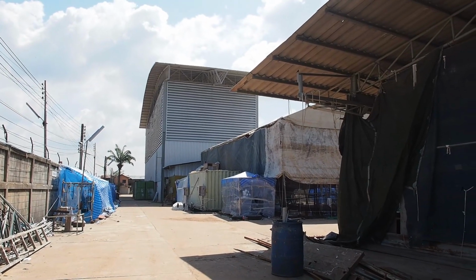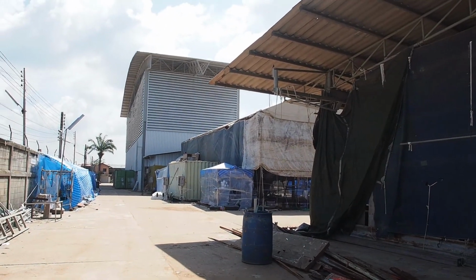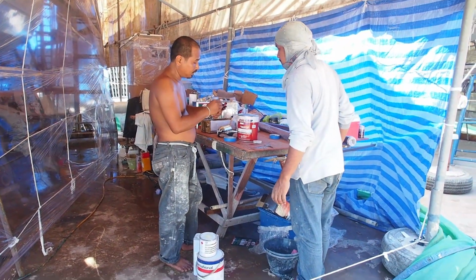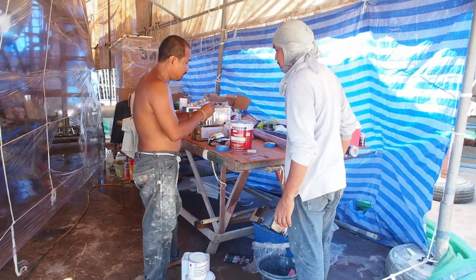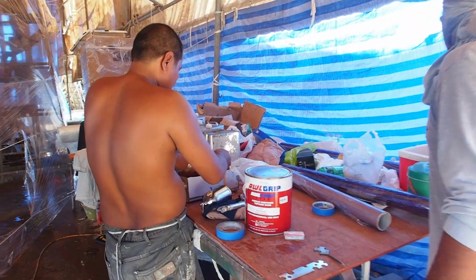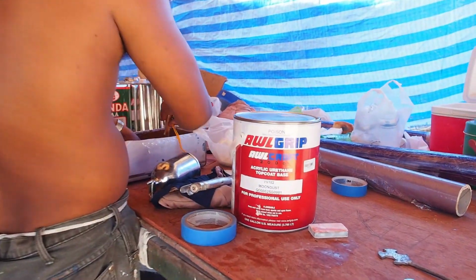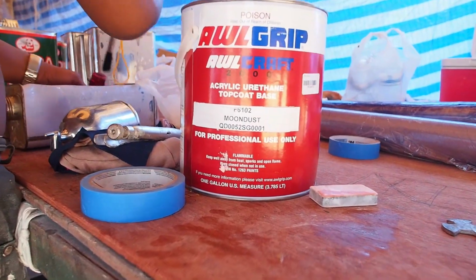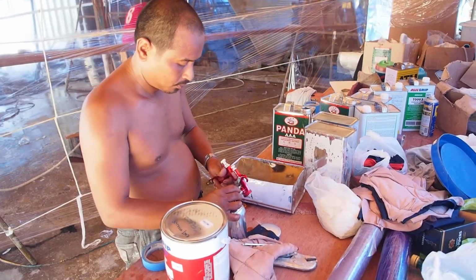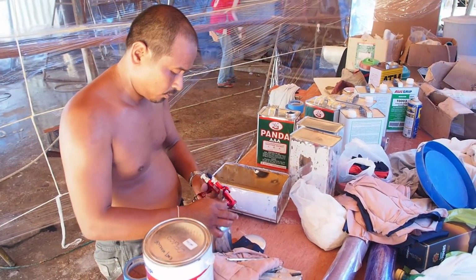So I've just taken a step back from the noisy tent over there. Been talking to Goy, the head painter. He just explained that he needs to put another layer of degreaser around the topsides before he applies the final top coat. So we're looking to get 3 coats on. It's 10:30 now, and he's estimating about 12 o'clock he's going to start applying the top coat.